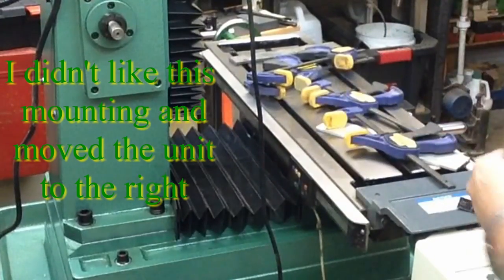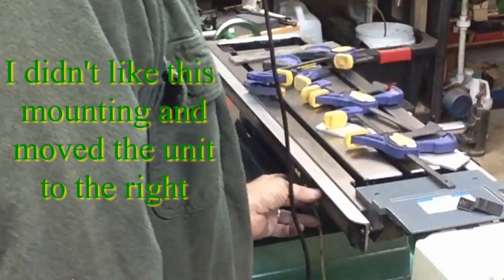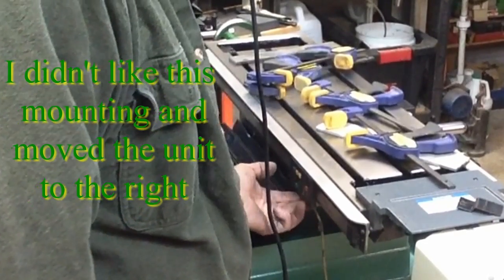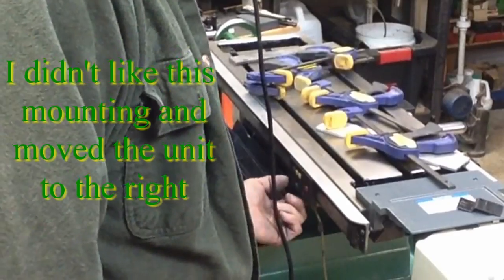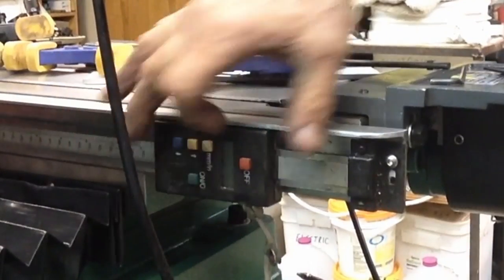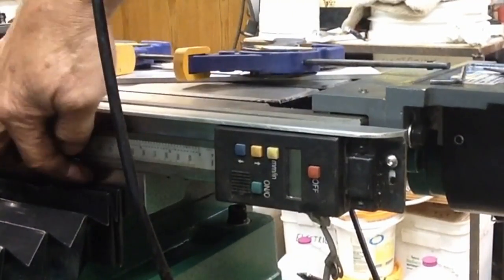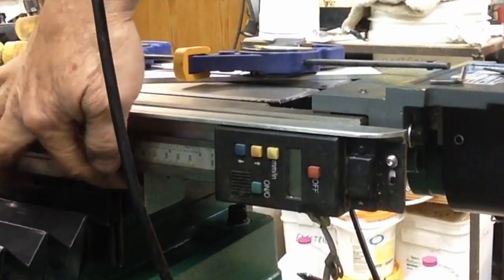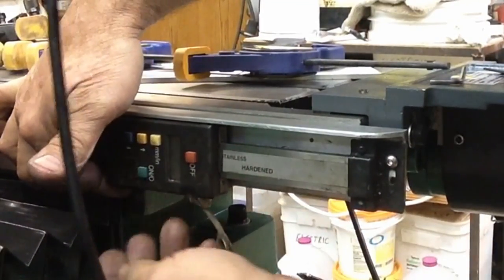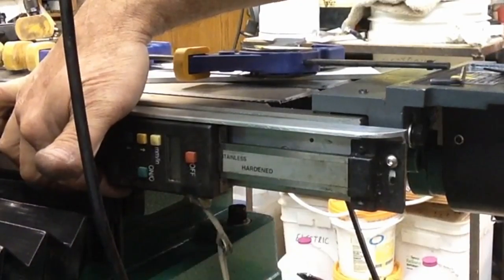And our scale head, we want to mount right in here someplace. So we're going to have to offset our little bracket to set underneath. Let me bring this camera down so we can see a little bit better. Okay, and here's our scale head. We want one end of our bracket to drill and mount right there. And then we'll just let that run on across and back behind the scale head, and it screws into the back of the scale head.